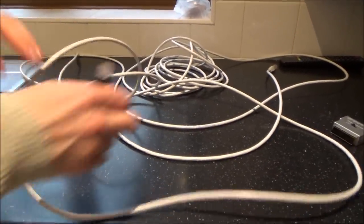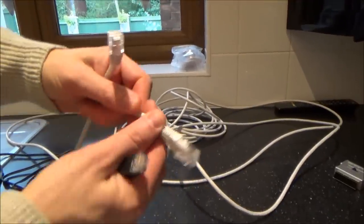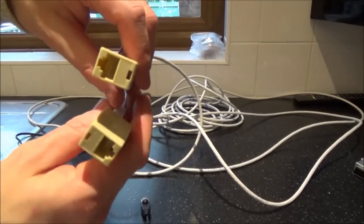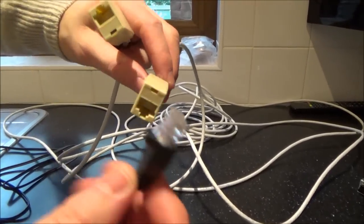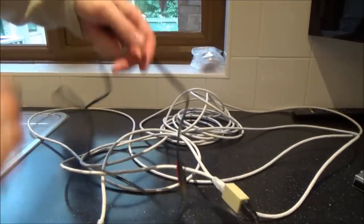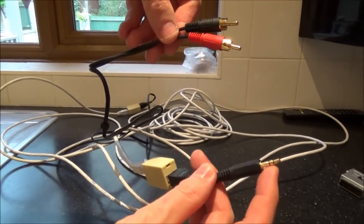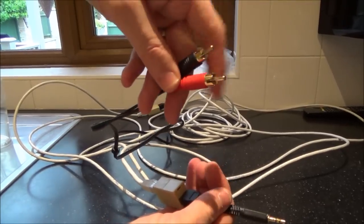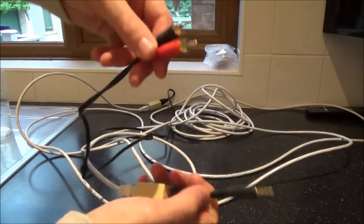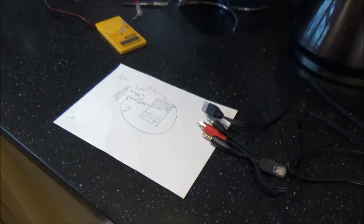To give you a quick visual example — pretend this is your really long ethernet cable buried in the walls. If it's just a bare cable, put a couple of RJ45 couplers on the end and now you've got two female RJ45 ports — same as having wall sockets. You plug your 3.5mm jack in one side and your RJ45 to twin phono adapter on the other. Whatever the length — 10 or 20 meters — you now have 3.5mm in to your Amazon Dot and twin phono out to your TV, or another 3.5mm out to plug into your hi-fi's aux in.